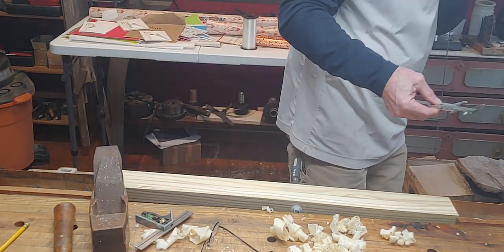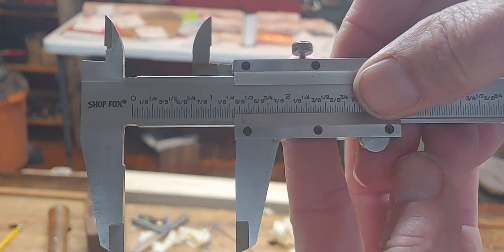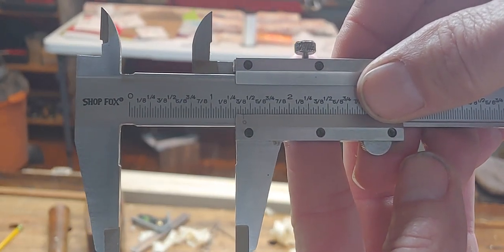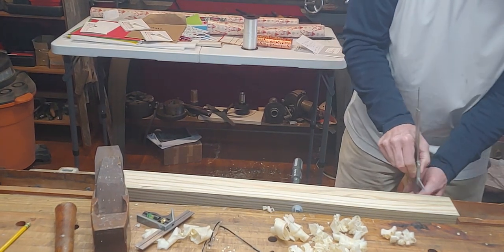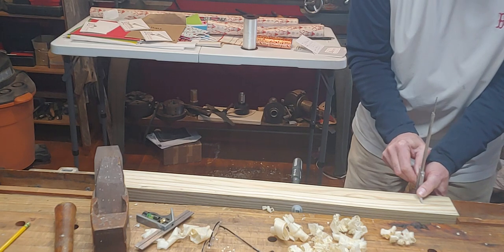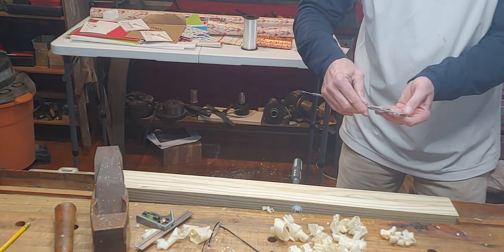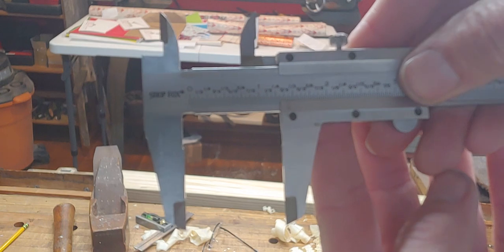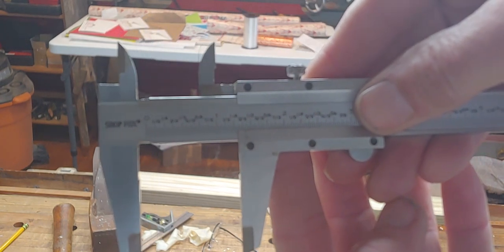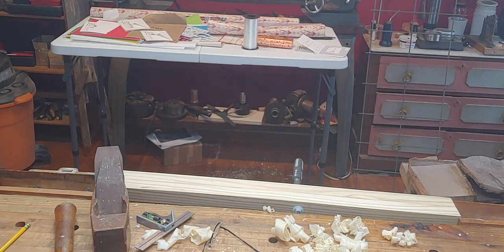So I'll show you this, show you this in the camera real quick. So that is a 32nd under an inch and 7/16. Quick, this can happen, of course, without using a straight edge, as long as you pull in full shavings. I'm not looking at the side here. Hopefully, you can see that. And it's a 32nd under, might be just a couple of thousandths over that. 32nd under an inch and 7/16. So right now they're the same thickness. They're square, they're flat, they're smooth.